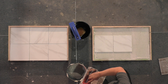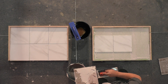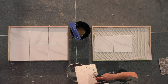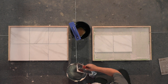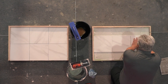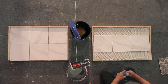BAM does it quickly, and that's going to offer an installer a little bit of protection on the job site. When you leave the job site, you have to assume and trust that nobody is getting onto your floor until the end of its cure period. With gauge porcelain tiles and large format porcelain tiles, that could be seven to 14 days with some traditional mortars before they're walkable or groutable. With BAM, you're at four hours. So the key aspect with this product is that it's fast setting, extremely workable, highly contractor friendly, and easy to use.